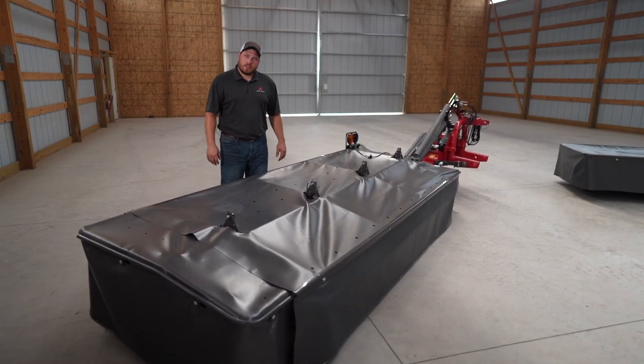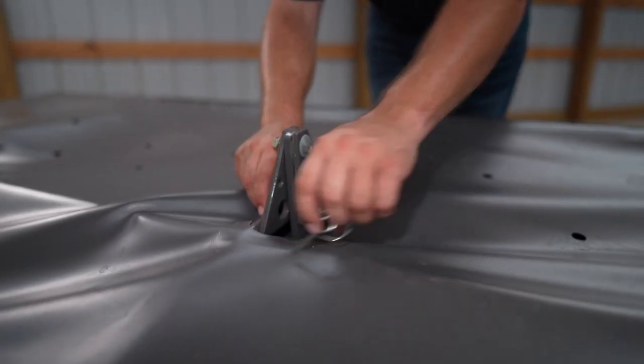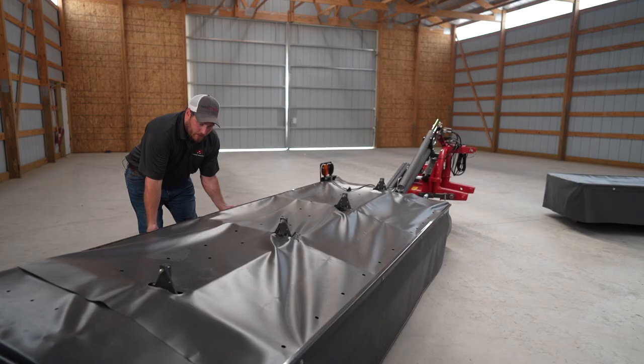Let's take a look underneath the curtains of what goes on here. To open the curtains, first remove the safety pin from the main pin. Lift the curtain slightly and remove the cross pin. Then either the front or the back curtains can be opened.